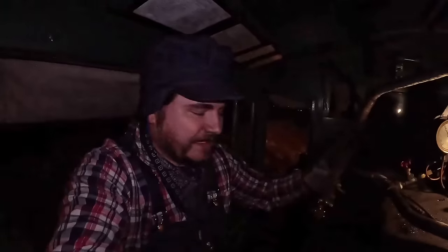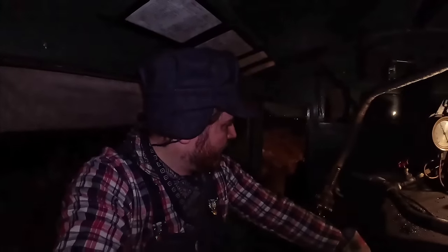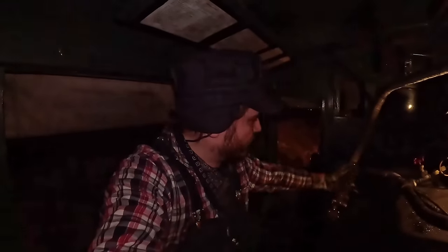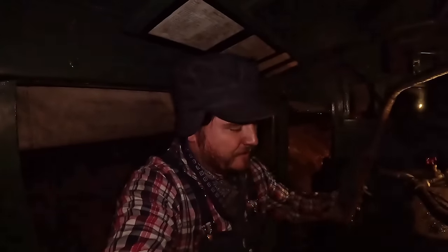I'm not gonna put any more coal in. I'm just gonna try and make more pressure with the blower as I need to, and use the air to deal with the fire. And then every time I get a chance, I'm gonna put 5 PSI worth of steam used through the injector. What I mean by that is that every time I put water in the boiler with this injector here, it's actually gonna cool down the boiler pretty significantly, because the water I'm putting in is cold. And when you're in a boiler, you have steam and water, the temperature and pressure are linked. So the more cold water you put in, the more pressure gets reduced.